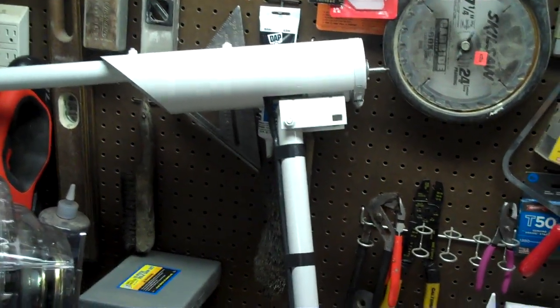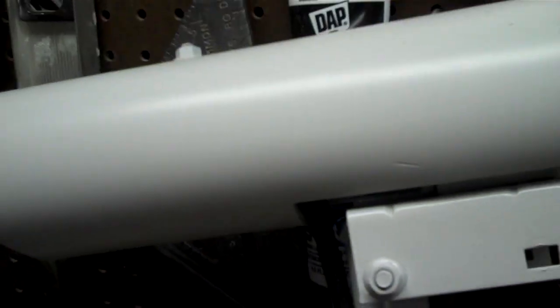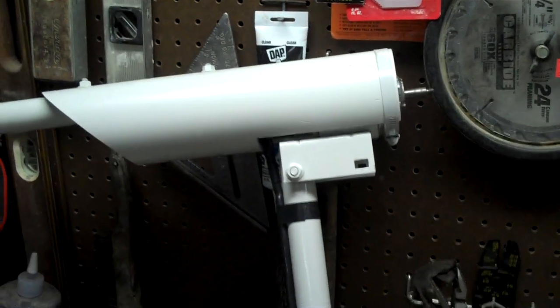You do need to have a diode — which I do. I did buy the diode; I bought a half dozen of them. That's just so that the energy goes from the wind turbine into the battery and not the other way around. You don't want the batteries running the motor.